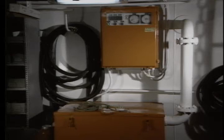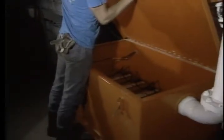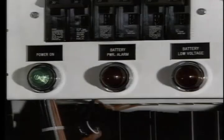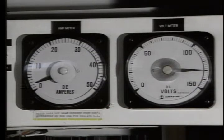The remote control system wouldn't operate without its electrical system, and it all begins here at the power pack. The unit can convert 115 or 220 volts rig AC power to 120 volt DC for use by the remote control system solenoid valves and push button indicator lights. The unit has two basic battery components: the battery bank and the battery charger. The lead-acid batteries are in a lead-lined box — there are 10 of them wired in series. If a rig power failure should ever occur, the batteries are designed to operate the remote control system for about 12 hours; they're charged by the battery charger. On the charger panel, meters and indicator lights tell you all you need to know about system operation. The AC power-on light tells you the system is receiving rig AC voltage. The DC low voltage light warns you if the battery pack is outputting too low a DC voltage. The meters read your output voltage and output amperage.